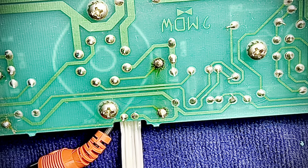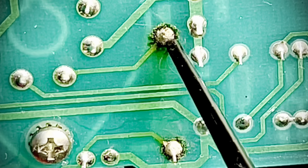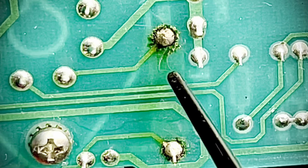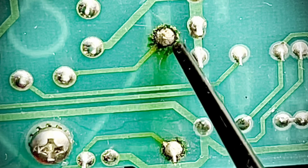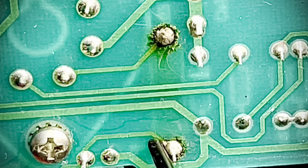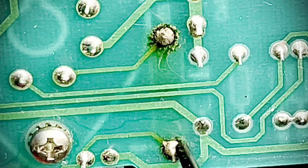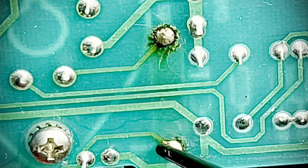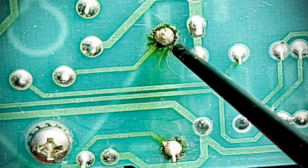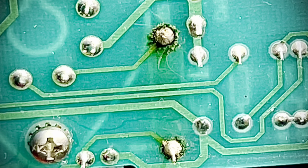All right. Let's see exactly what kind of damage we're dealing with. When you see this, look at the texture. You see that? It's cloudy. It kind of has a bit of a rough, coarse look. Most likely it was overcooked. You can see that here because some of this mask probably peeled back from him just using a blowtorch. So let's just clean this up and see what we're dealing with.